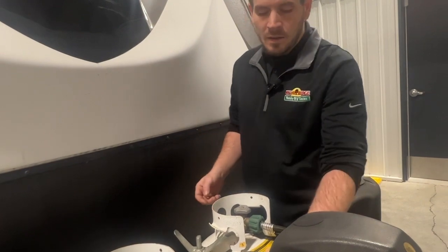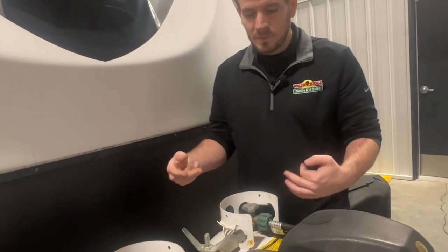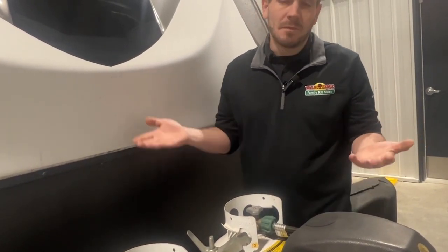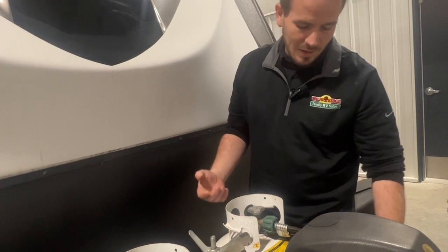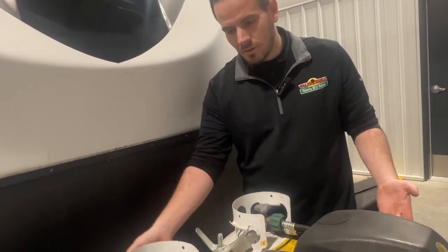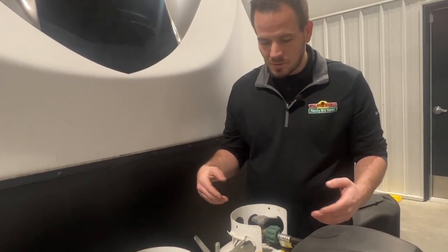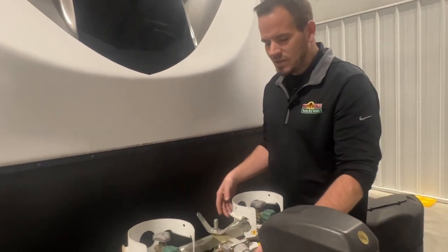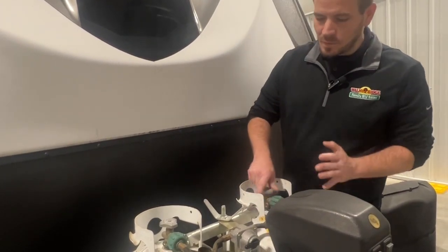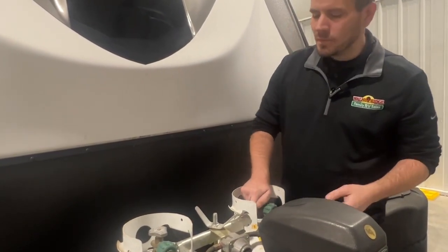The only problem with doing it the other way, where you have both tanks open, is that if this switches, you won't notice. Could be for who knows how long, and now you may have this tank all the way empty, and that tank's already empty, obviously. So once it started drawing off this tank, could have been a few days ago, you don't know exactly how much you have. So at least when you leave one of them off, you know that you have one tank, and you know you have however many days it takes before you burn through a tank typically.